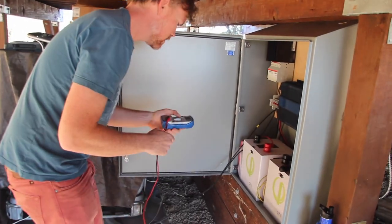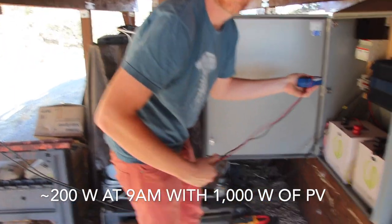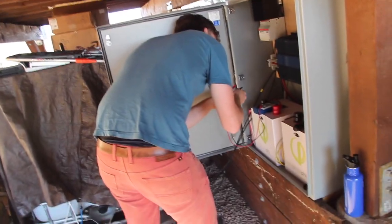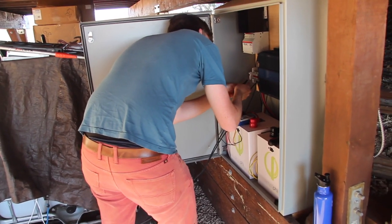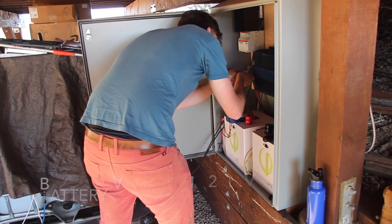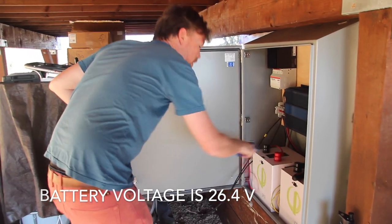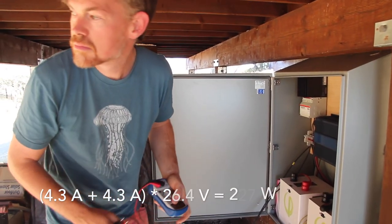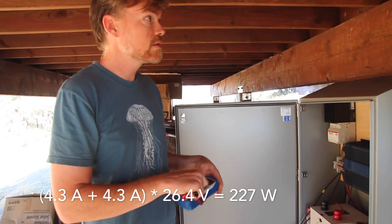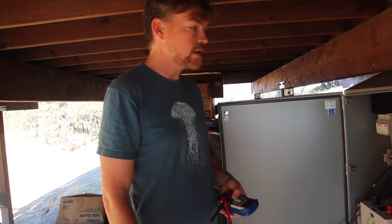Let's see what the voltage is at. For 9 a.m., not bad - pretty good. About 25% power. It's actually 26.4 volts, so a little bit more - probably 250 watts. We want to see at least 800 to 900 watts, meaning all the panels are working at about noon. We'll see how it goes.